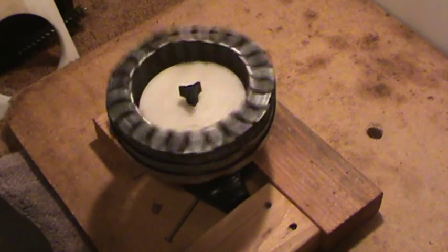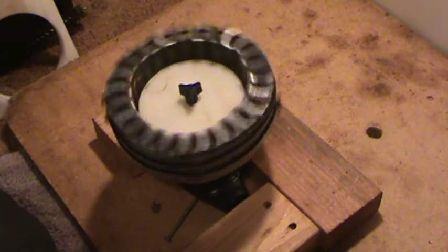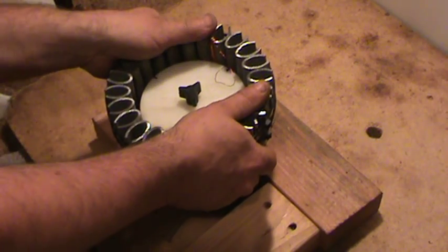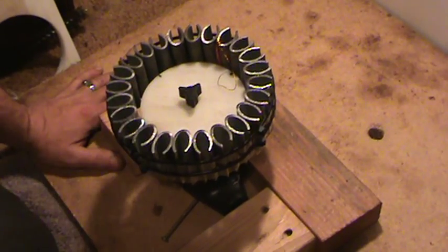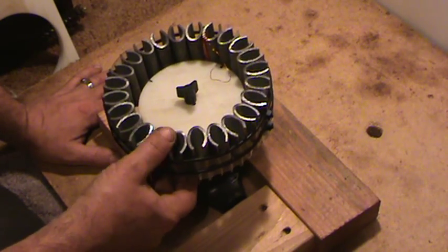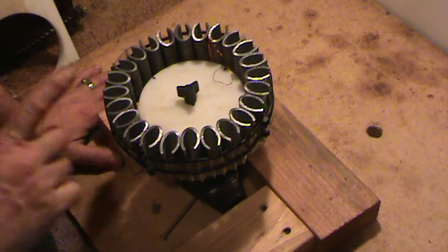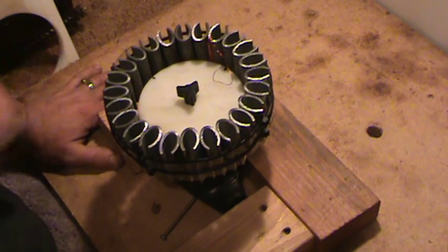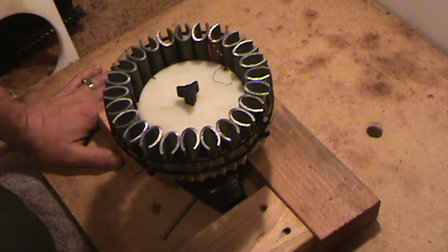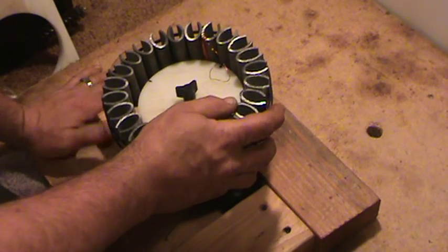Anyway, there it is — the finished model. I can tell you right now that this has more output than the original one does, and I think it really is because of the zinc on there, because I left most of the zinc on. Something I do have to mention is that I did put a little bit of terminal grease on each of the connections — just a tiny little bit — just to keep those connections clean, because it is going to be sent around so people can check it out. But I am going to keep it for a little bit and do a couple more tests on it.